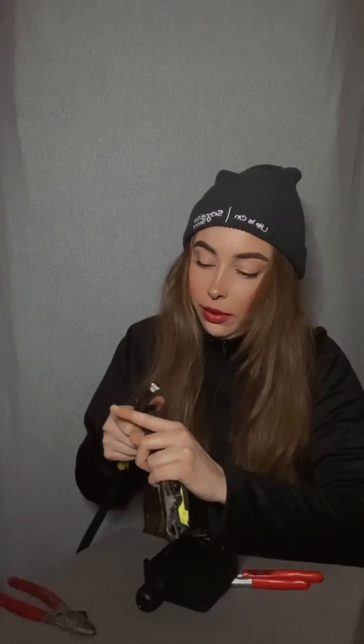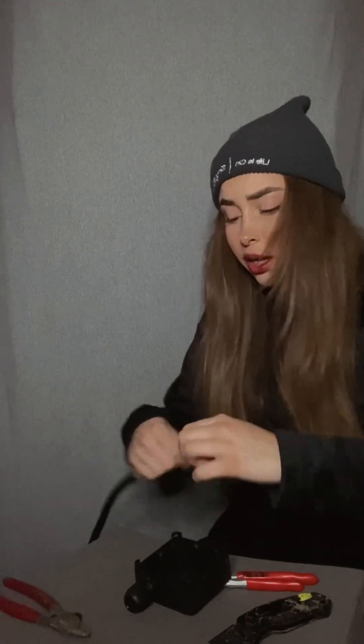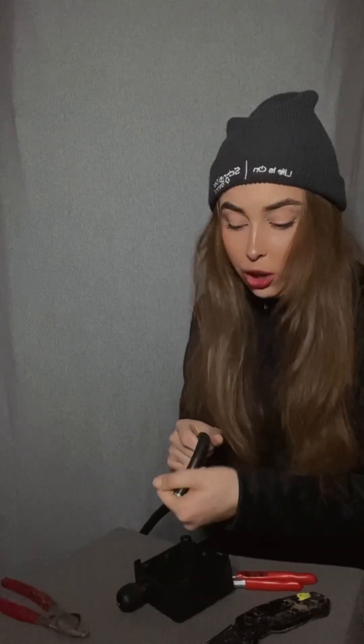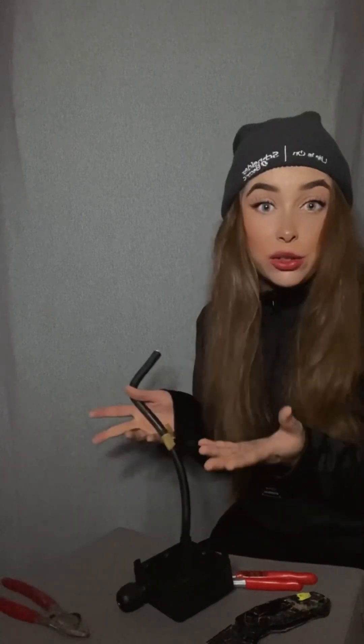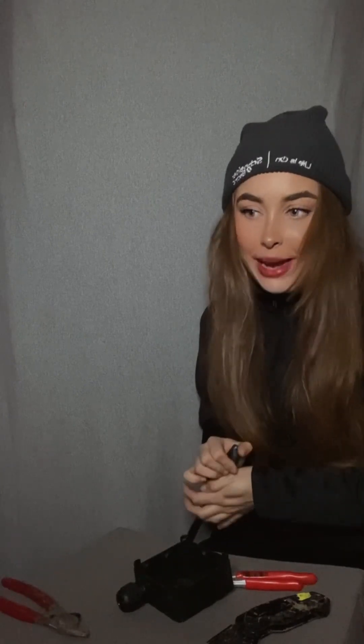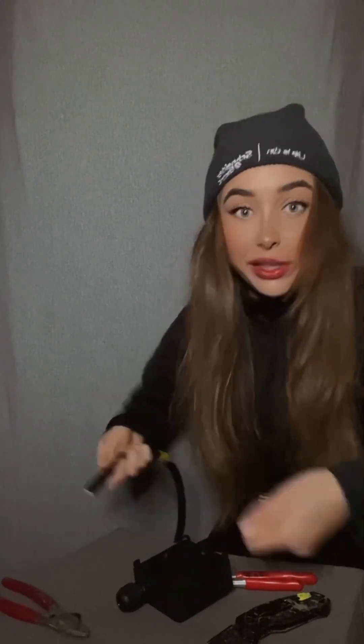Just prepping the cable so we can test from here. Picture this as a scenario: there's an MCB feeding a cable and it feeds a wiska box. The MCB has tripped — why? Long story short, it's either pulling too much current — say if it's a 6 amp breaker and it's pulling 10 amps — or there is a short circuit somewhere, which means a live cable is touching an earth cable, and obviously they're not meant to touch.